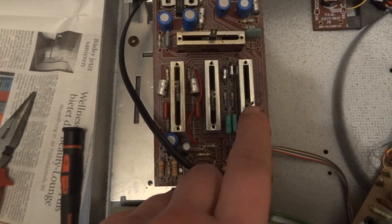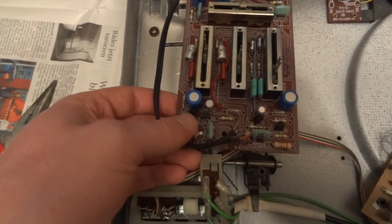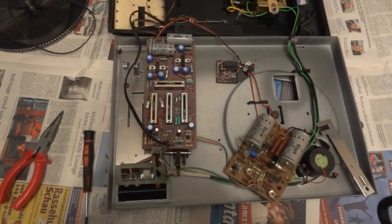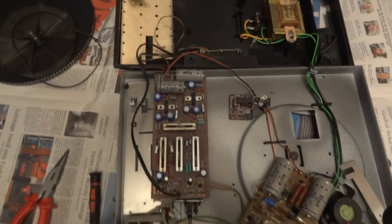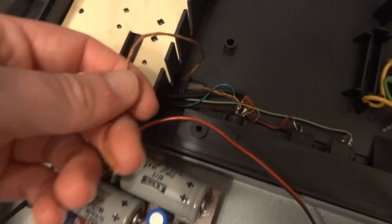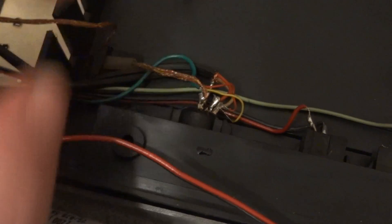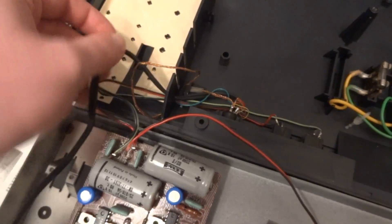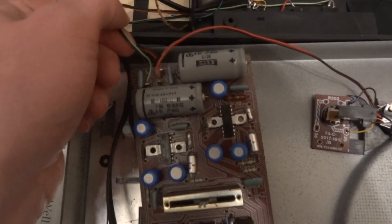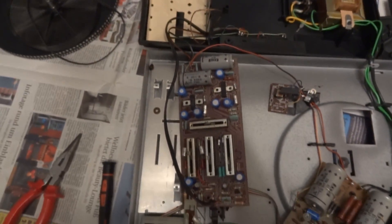The preamplifier with the tone controls, as you can see, is almost all passive. They do actually have two transistors in there. This is the input, and this definitely was a crystal cartridge — the levels had to be quite high because they were actually feeding those into a switched DIN jack. This is where the tonearm would have hooked up, and that's soldered straight onto the DIN jack. If you plugged a wire into that, the DIN jack would then switch to that wire, and that is where the amplifier part is hooked up. So it is in fact a DIN input, and from what I can tell, it is not at all an output — no record output on that one.